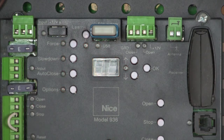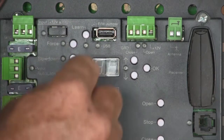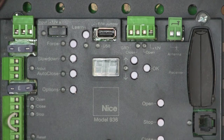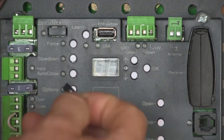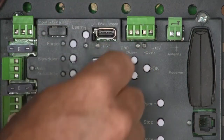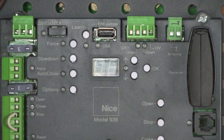I'm going to unplug power and unplug my USB thumb drive. Make absolutely sure that you remove the jumper — you cannot leave it on those two pins. You can store it just on the bottom pin if you want, or lay it in the bottom of the control box. It doesn't matter, but you have to take it off those two pins.